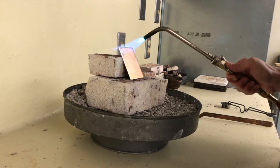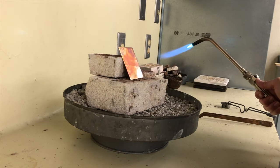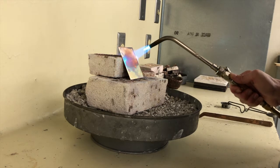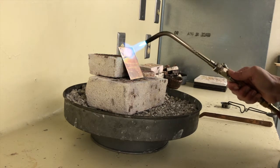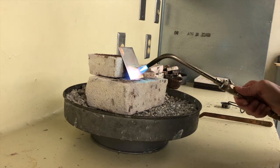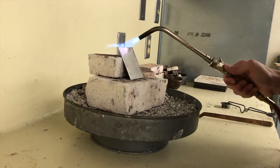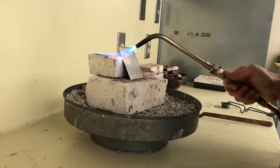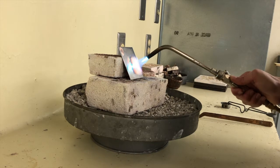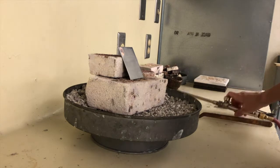I always tell my students: don't scribble with the torch, just nice and easy strokes — keep that heat on. So we're at the rainbow stage. Your torch needs to be about an inch away from the blue cone for its hot spot. Now we're at that black stage — just keep a watch on that flux, because now it is starting to look like a mirror or glassy. Now it's a mirror, and I can also see that the end of the torch tip is turning bright orange. That's where it's annealed.